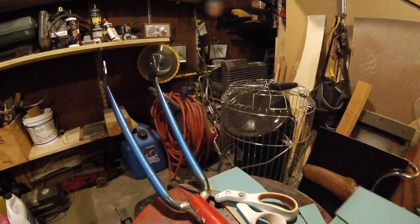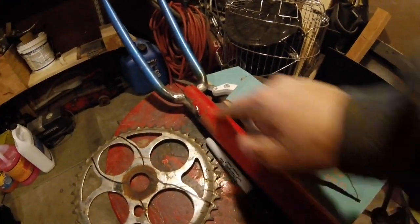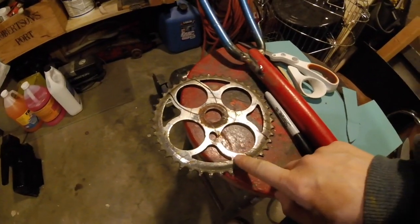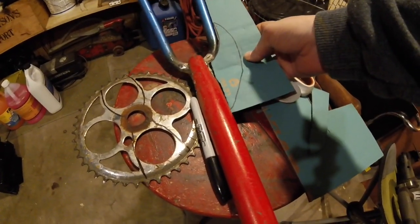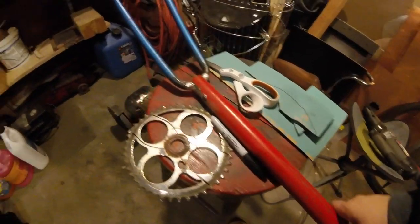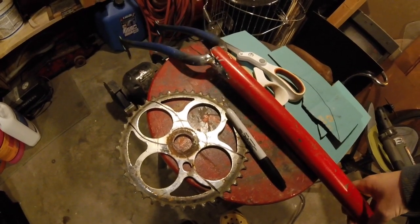The simple solution would be to use a front fork on the bicycle, but to make sure I have enough strength since I cut part of this off — we've lost half strength. I hammered this pipe on after I welded that piece underneath, prettied that weld and got it welded back up, hammered this piece on. Then I'm going to take this sprocket and make kind of a gusset to go right there, heat and bend it so it comes up like that. I want to try and see if I can make this work. We'll go cut that guy out and weld that in if it looks halfway decent.